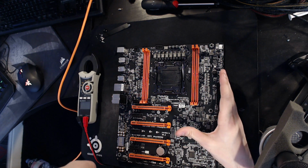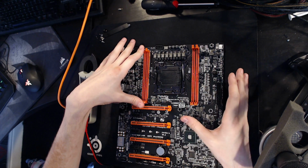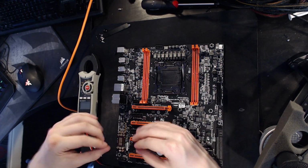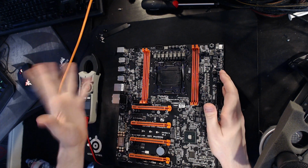I'm so used to GPUs that I'm like, card. Anyway, so just memory power, ridiculous. Now let's talk about the Vpp rail. This is a really minor rail that is necessary for DDR4 because it's a voltage that used to be generated internal to DDR3, but for efficiency purposes, it's been made external.